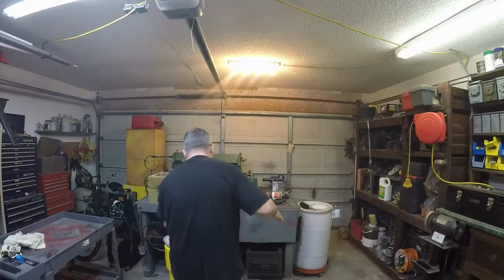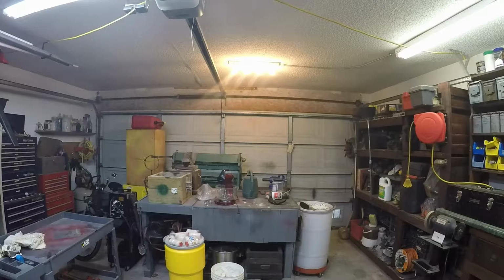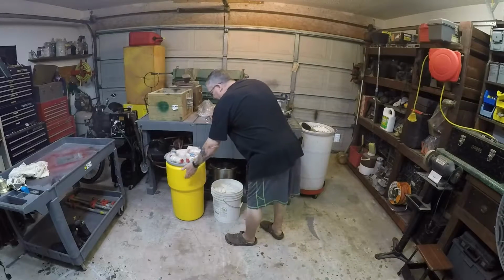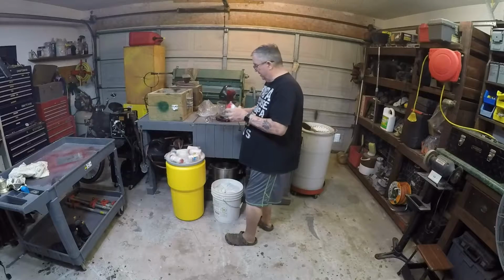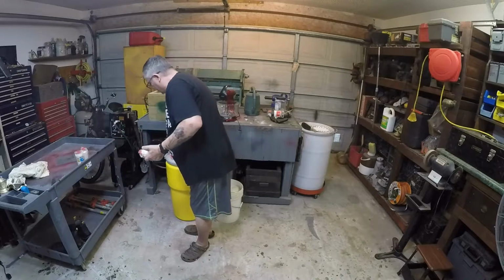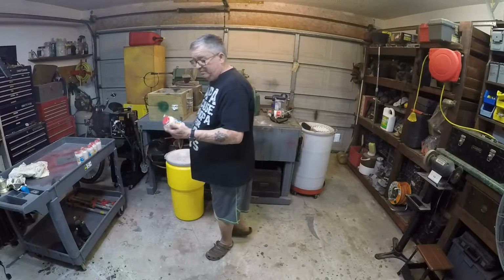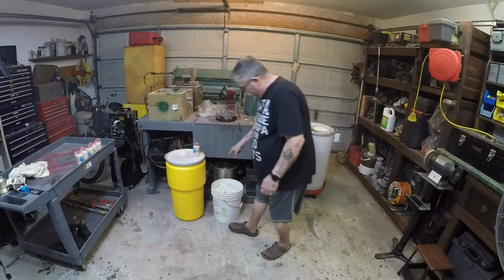Inside this is the silica powder. Let's see if I got aimed good enough to where you can see it. Probably not, so I better go down a little bit. Inside the yellow container is the silica powder. Inside these is dextrin. This is kind of a good way of having it, because you're not going to want to have these all exposed to moisture in the air. This is something that bacteria might latch onto. You want to keep it out of the atmosphere so that you won't expose it to unsavory environments. Okay, so here's your dextrin, here's your silica powder, there's bentonite.